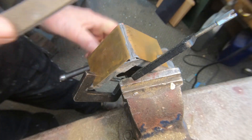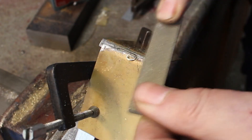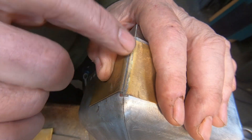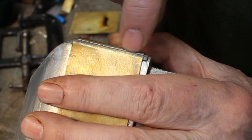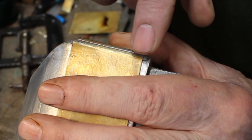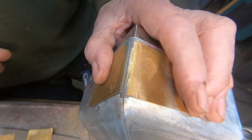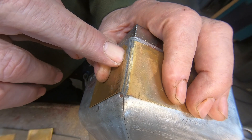That hasn't worked. As you will have seen, the brass wire didn't stay in the joint. I think because as I swaged it down into the groove that I filed in, it weakened the solder joint. So swaging the brass in isn't the solution. I need to work a bit more on how to get an invisible joint with soft soldering.